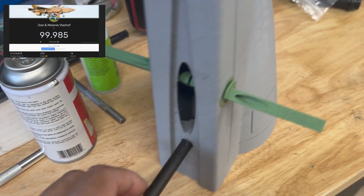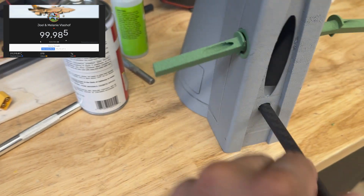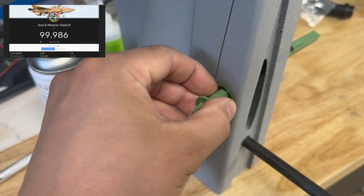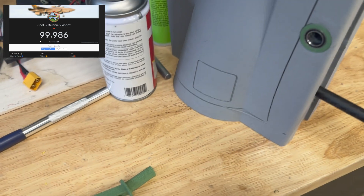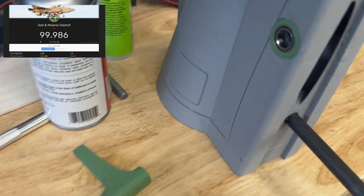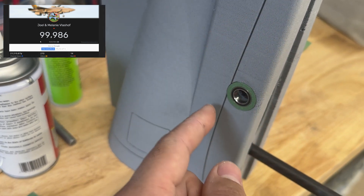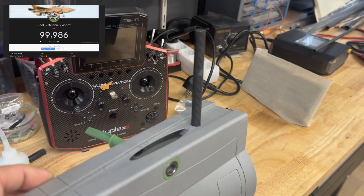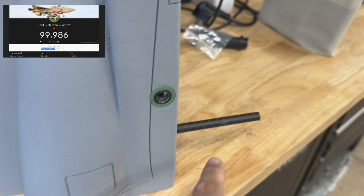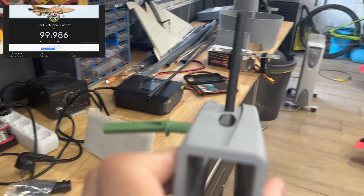And if we look at this part — I really printed it, so we've improved again. It's all about iterations with this prototyping airplane. And this is actually the final, final part. You just slide them in into the bearings, and then I think it will hold nicely. So this is the carbon fiber PLA part which is glued into the foam filament, because foam filament is quite soft, and this makes it really stiff. I use a bit of epoxy to make it really strong. Also for the first time, we're going to use a carbon fiber rod for holding the rudder, and it's pretty nicely aligned.